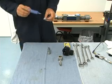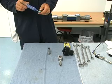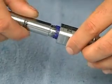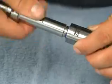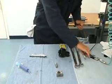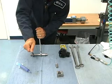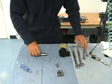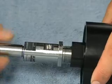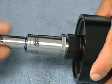Then next, I'll blue goop the threads on this nozzle body. Thread it in and tighten it up. We want to tighten this down before we put it onto the actuator. Now we have this, and we're going to screw it into the actuator until it comes up snug against the o-ring on the actuator, so it won't go anymore.